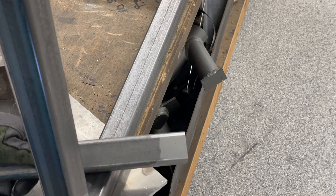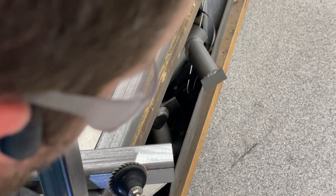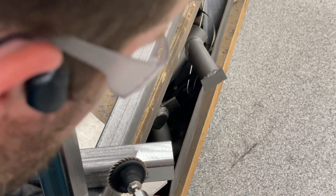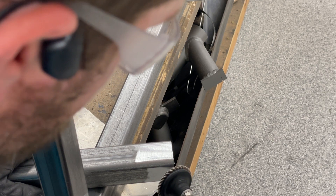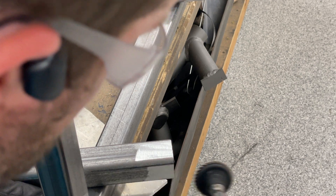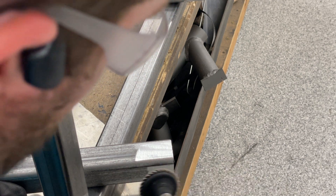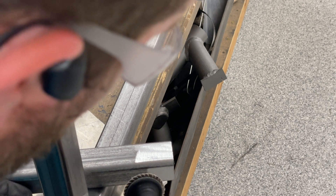So you see how these are all nice and clean? On the next tube, I am going from the metal to the edge — I'm not going from the edge to the inside. In general, that's actually the way you weld: you start from the area that has a sharp corner and go inwards. But with grinding, you go the other way. You start from where you are most stable and go to where you are least stable. You are least stable at this edge where you start falling off.